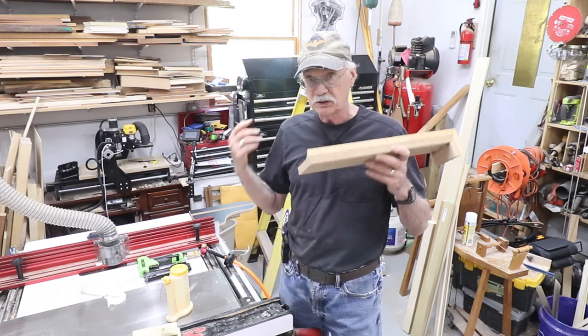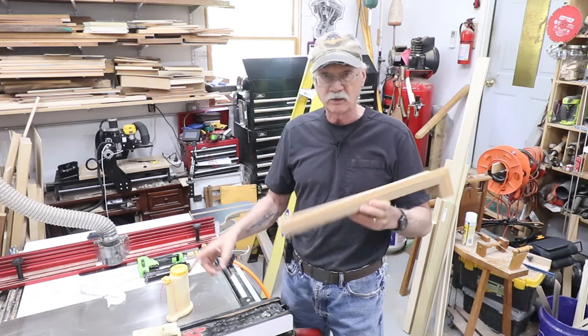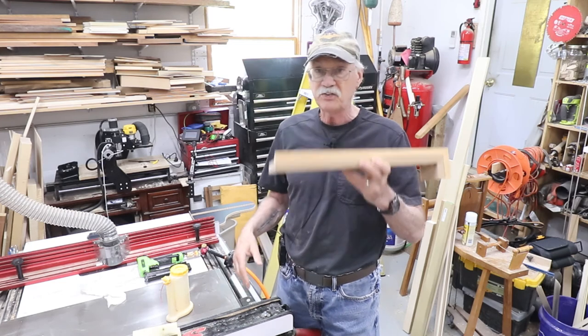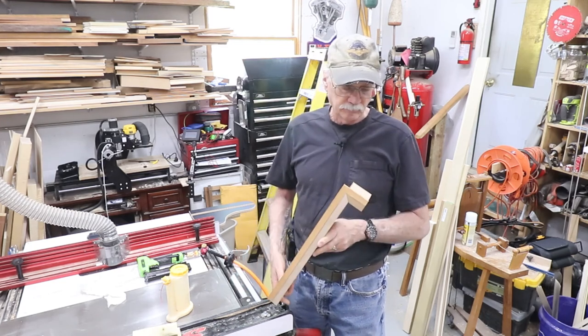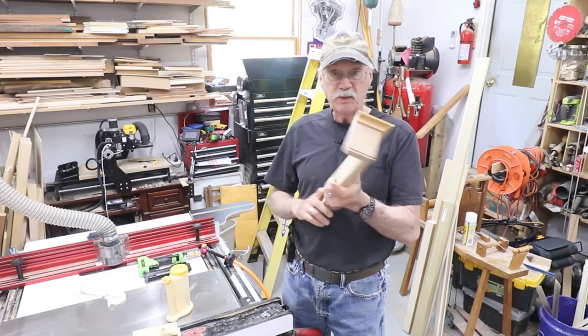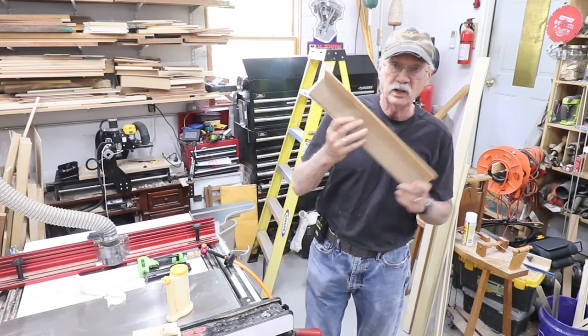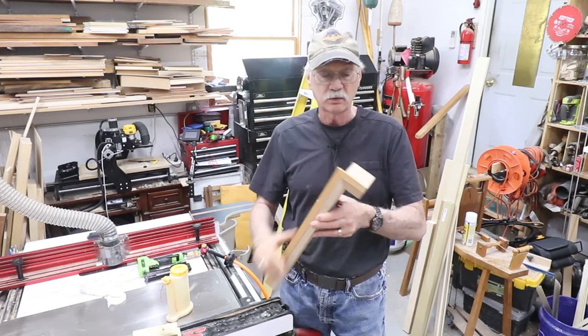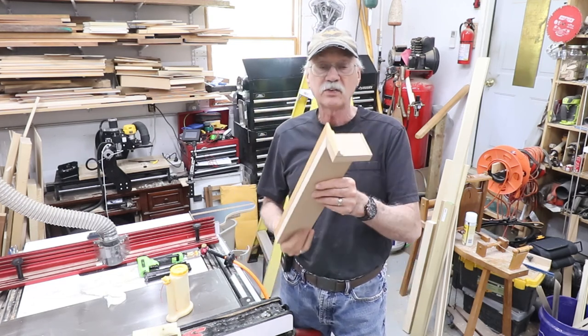Of course, when you use shellac, you spray it down with shellac until the shellac is all soaked in and cured, and then give it a light sanding, that seals it for painting. That sign video I did earlier shows that. So that's basically how I did all of the headers and all the valances in the house. And it's a very simple process.